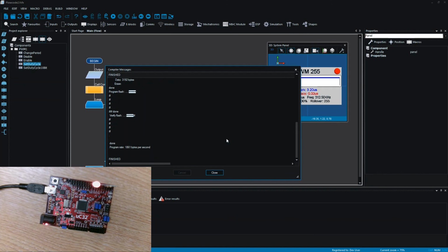the programmer, and then hopefully you can see on the video that the duty to the LED is increasing, and we've got like a stepped effect in the brightness of the LED. So it kind of increases in a gradient and then jumps back down to zero. That's right. I mean, you could use this for all sorts of things, controlling a motor, making a torch with a variable output. You know, the uses of this are very wide and varied. Brilliant. So, I mean, PWM is quite a common technique for... It is. It's a way of generating analog from a digital output.